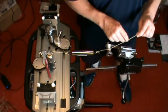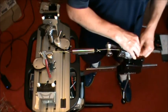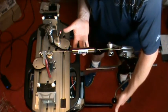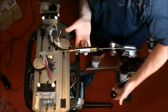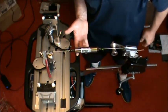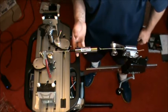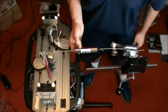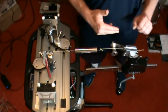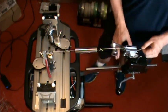So we think that this is set to 40 pounds. Well, it is set to 40 pounds. We're hoping that this will be 40 pounds. So let's check. Now that we know how to do all of this, we're going to turn this and see what it reads at the moment it hits lockout. And I know you can't see it, but it's not even 35 pounds. It's more than 30 and it's close to 35, but I couldn't actually see the little white hash mark where the 35 would be. So it's pulling, let's say, 34 pounds, 33 pounds, according to our calibrator. So we know that we want to make an adjustment so that this goes up and gets close to 40, which we have set over here.